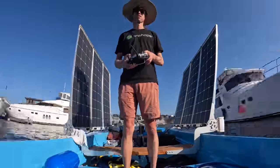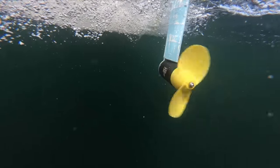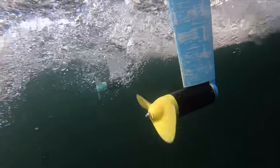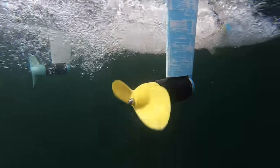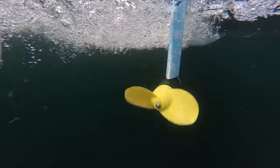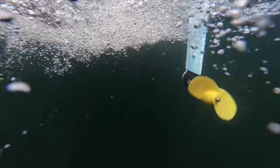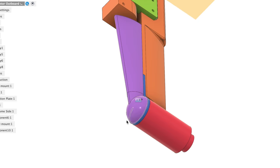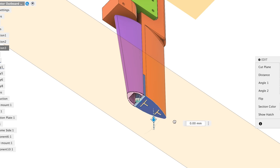Now back to the video. If you've watched the previous videos about this boat project, you've probably heard me complaining about how the props are vibrating while underwater even though they are perfectly balanced and run smooth in the air. This was around the time I began to think the vibrations weren't from imbalance, but instead from the prop blades chopping through the wake created by the vertical mast portion of the outboards that is made out of 2x4s. Since only one side of the blade is passing through the wake at a time, it would lead to an imbalance of thrust and an imbalance of force on the motor shaft, which would cause vibration. This is more likely to be a problem with my design because my 2x4 masts are really much wider than they need to be — still a proper foil shape, but way too thick.